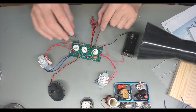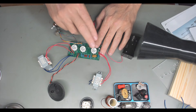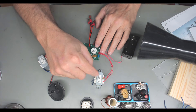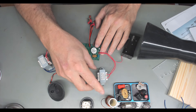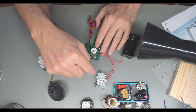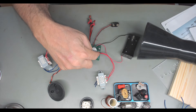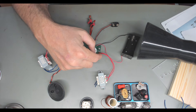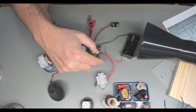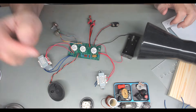You might notice a couple of other additions — we put the transformers on. This transformer here, marked T1 on the board, there's no polarity. It's not really being used as a transformer; it's the RFC, the radio frequency choke in the circuit. I went ahead and cut these wires off shorter, and I ohmed out these transformers — the 220-volt side is the red leads. This was supposed to be hooked to the 220 side for the RFC, according to everything I could find.